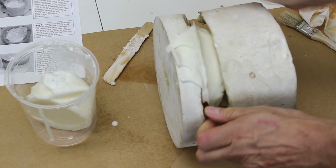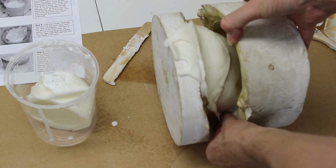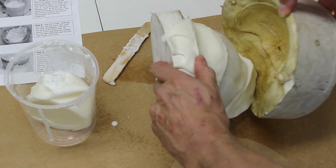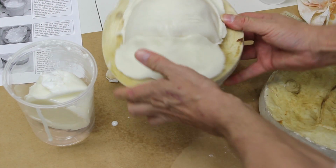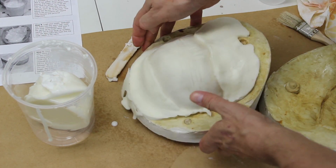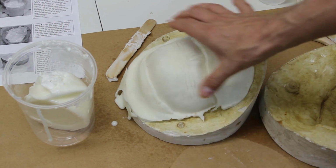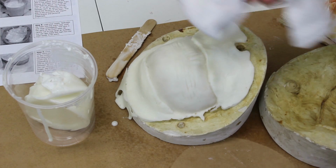Once the foam has loosened, you can separate the mold halves. Be careful not to tear any foam that is still attached to either half. Once the mold is open, inspect the appliance for defects and powder just as you would a foam latex appliance.